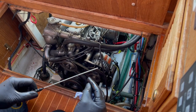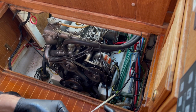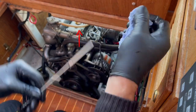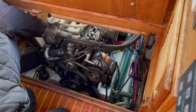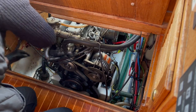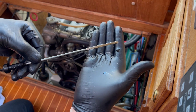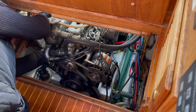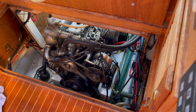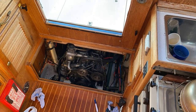After running the engine for 60 seconds or so, you go back and re-dip it — and it's at this point you want to set your level, normally to the maximum but certainly not above it. The dipstick's a bit easier to see here because it's flat and not round, so I can spot the oil level — it needs a little bit more. I'll put a little bit more in. After topping it up and running it, you can finalise the last dip and make sure that your oil level's exactly where you want it. Keep the dipstick downhill so it doesn't run down the stick. Check it — we're happy with that. Spot on. Let's put that dipstick away for the final time. Then the cap — mustn't forget to put the cap on. And that's it, job done. Just put everything back together and you're ready to rock and roll.